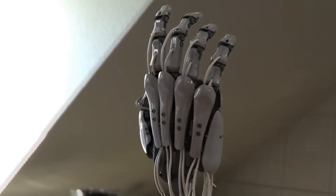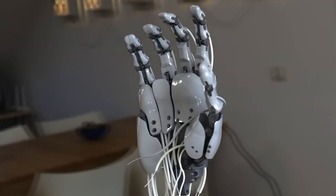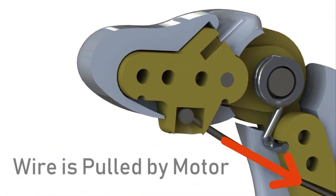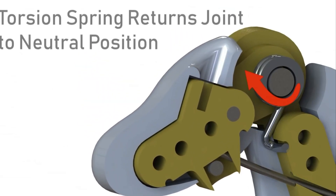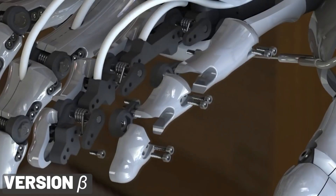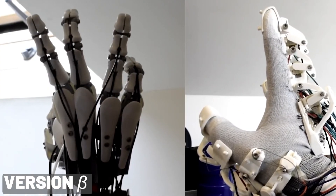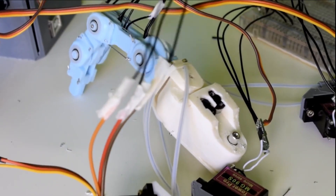During university I started a new 3D printed bionic hand which controlled each joint using a tendon system — a motor inside the forearm pulled on a piece of string to effectively puppeteer the joints from a distance, allowing a much more complex and dense design while keeping the power of larger motors. Version beta had a spring in every joint and more fasteners than McMaster-Carr, so it weighed too much and didn't move that well, but I did build and test a final version.